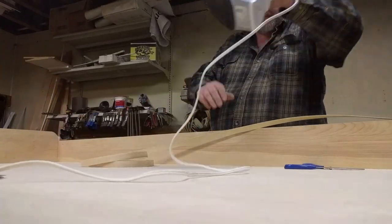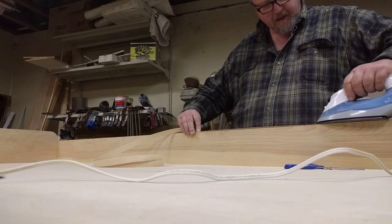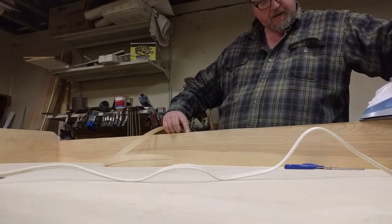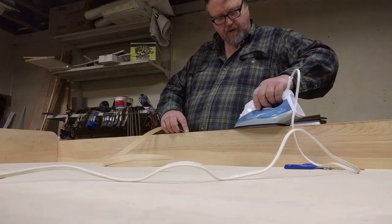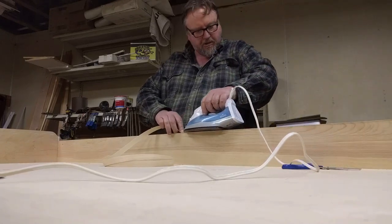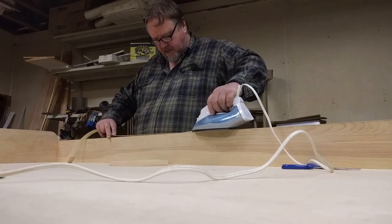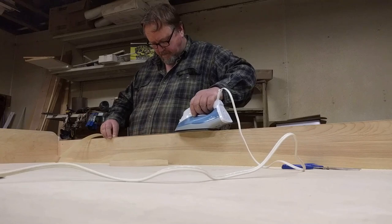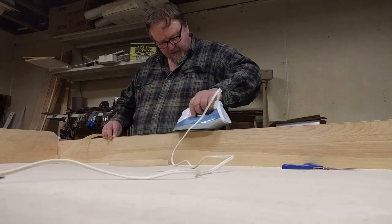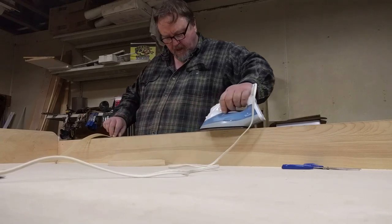I'm hoping I can get this all on film. I've kind of propped my camera up in the corner there. I'm going to iron this down so you can kind of see how I do it in case you wanted to try this yourself. You just can't leave it on there too long and darken the wood — it could burn the wood. I actually lean it a little bit on the edge to make sure those edges are hooked down really well. Let's do a section at a time here and make sure we get it good. I see a splice in this where they spliced it together — I don't like that, but at least it's on the back edge of the bed.